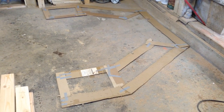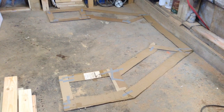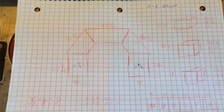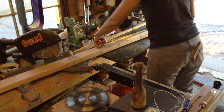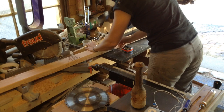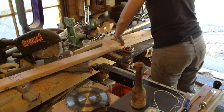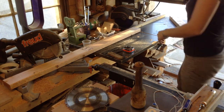For this next video, I'm making an angled banquette to go in someone's kitchen for seating. The first thing I did — what's laying on the floor — is take some measurements and make a template. The template is going to help me get all the angles proper. I went over to the house with some cardboard, lined it up perfectly against the walls, and made a rough template.